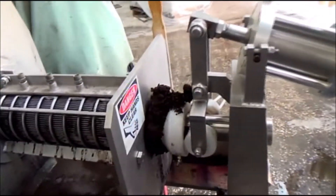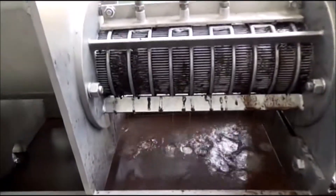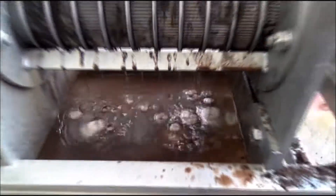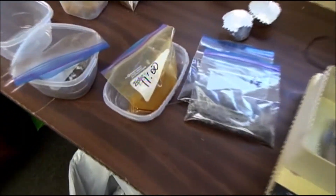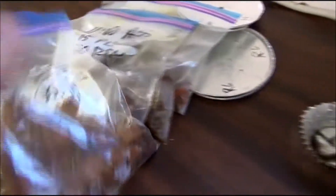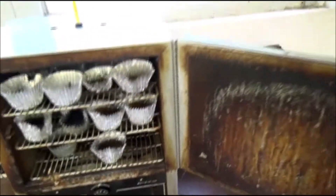This is going very well — that is a good throughput for a CP4 screw press. Press liquor separation is good; we're getting some of the free water at the beginning and squeezing out the rest, though not getting much in the middle. Here's where we run moisture analysis — both press liquor samples and moisture content samples from yesterday's testing, and here's the coffee. We have an oven we keep below 100 degrees centigrade. Press liquor looks like this when it dries out. We'll have the results later on today.